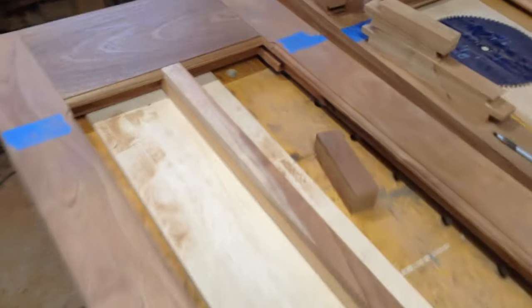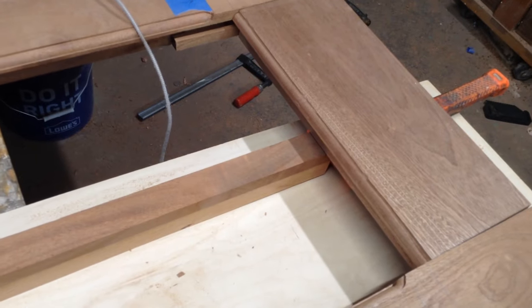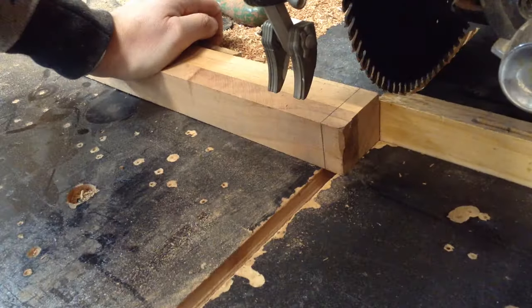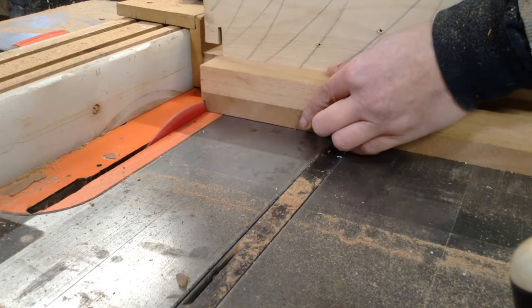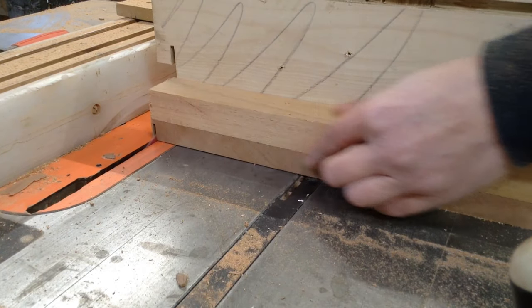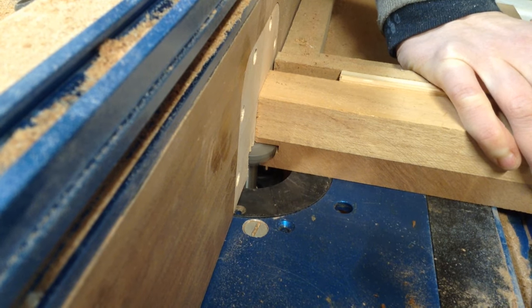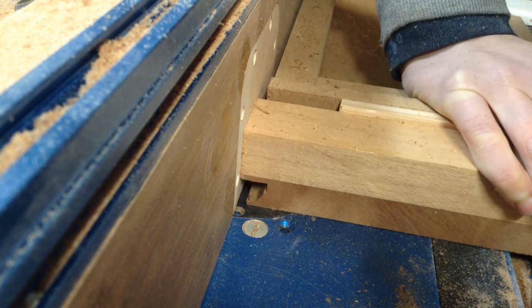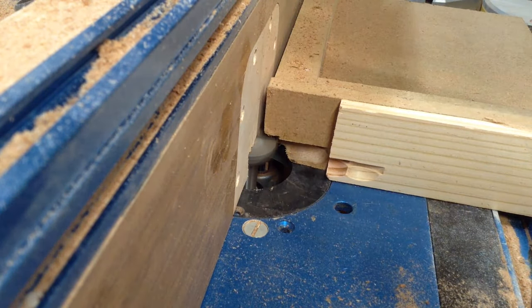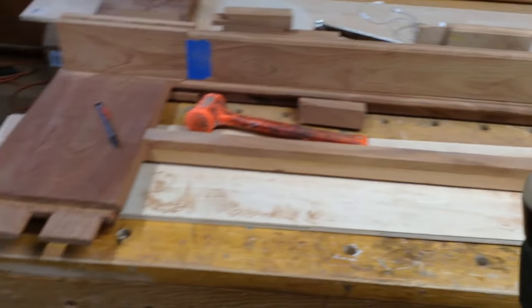The top side is a different dimension where that piece of material will meet the different profile on the top side of the doors. Once I had one edge done I could lay the doors on top of it, measure the final vertical, and cut both sides. On this one I'm removing a little bit of a curve cut because if I didn't, the bottom side of my stock would hit the shaft of the blade going into the router. Removing that kerf clears it, and then I have those two pieces in place.